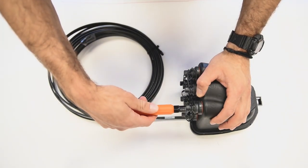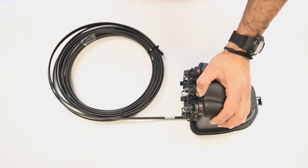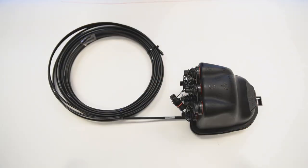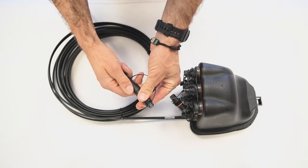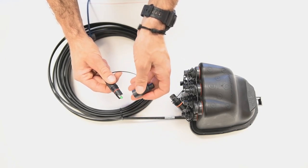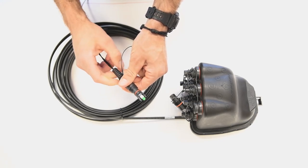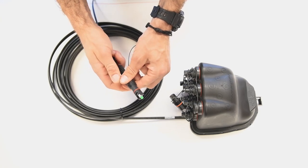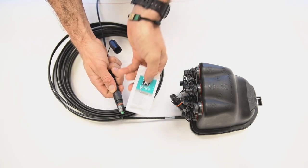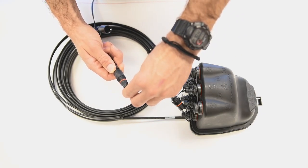Multilink Surelight HIP hardened connectors and FiberTap Plus fiber access terminals fit the footprint of and are fully interchangeable with several of our competitors' connectors and fiber access bulkheads. Prior to inserting our competitor's hardened connector into a fiber access terminal bulkhead, be sure to also inspect the red connector O-rings to ensure that they are not dry. If dry, apply the vendor's selected lubricant to each O-ring. Note that the connector O-rings are pre-lubricated by the factory during production and should not require further lubrication during installation.